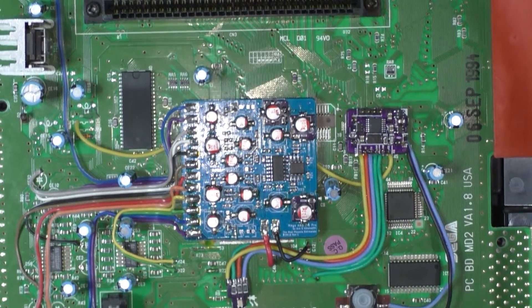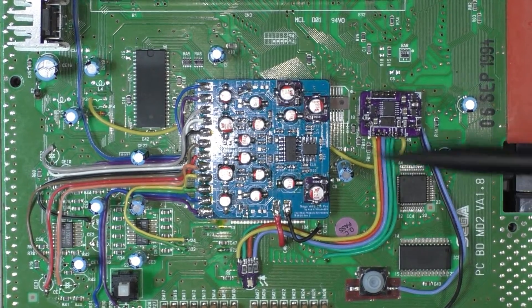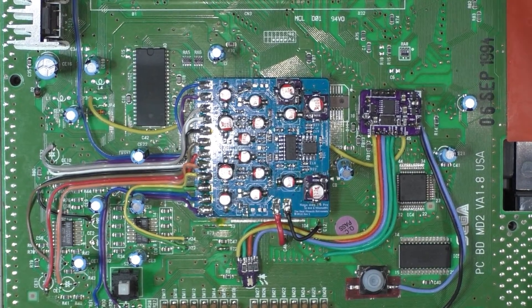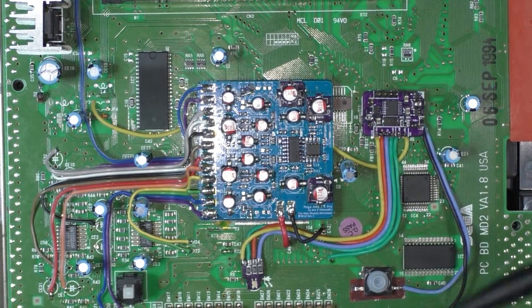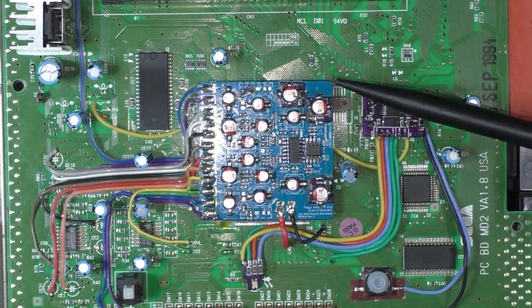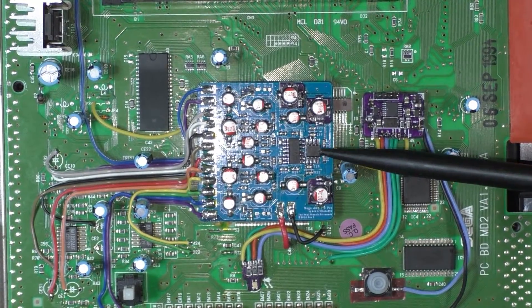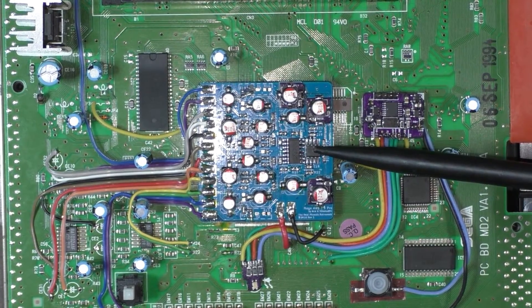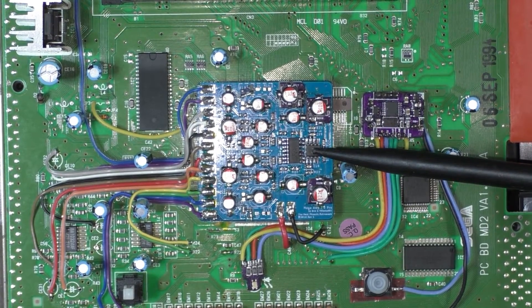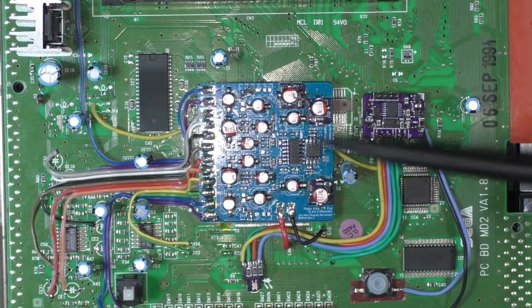It's just working really great. On the Sega logo, when you pick up a ring in Sonic, all the sounds in Superfetch are really, really way better — you can really hear it without needing super hearing. I'm going to put everything on GitHub. The next revision will be smaller, already optimized, no patches like that. One more thing: the op-amp used in the description on Sega 16 for the Mega Amp 2 is no longer available — it's already end-of-life on DigiKey. So I asked, and FirebrownX answered with a drop-in replacement, which I'll include on the components list.